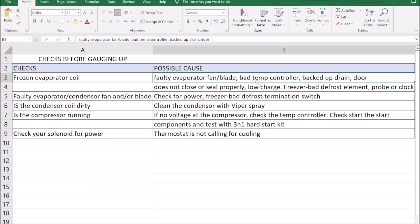Let's say I think the temp controller is bad and I'm not really looking at the ice pattern. At that point, I would fire up the unit and wait for it to get to temperature, and once again it would not get below 51 Fahrenheit — but I would waste a good 30 to 45 minutes. So it's very important that we look at the ice pattern, because how it's freezing is going to tell us a lot of the story.